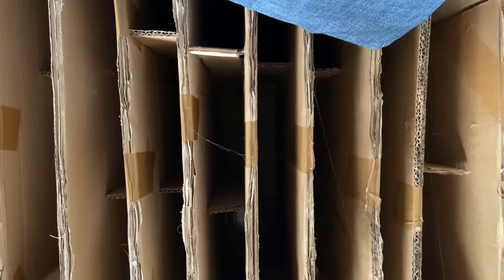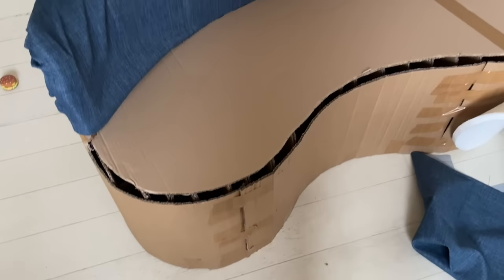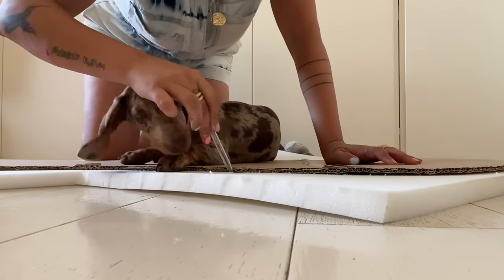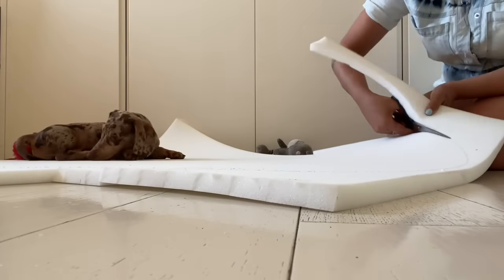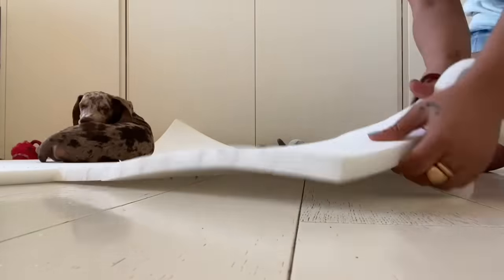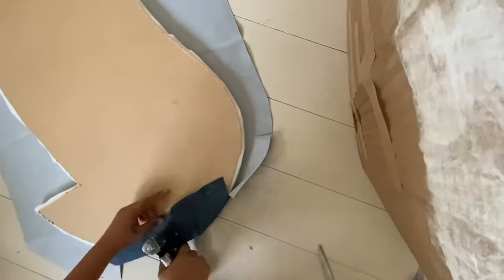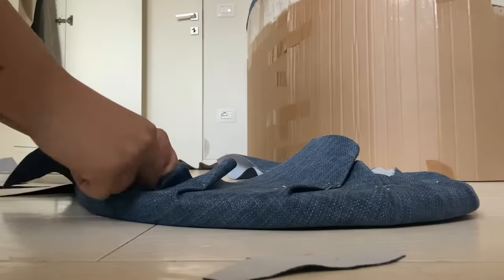Now you can finally staple your fabric around the cardboard. For the front I first needed to place a straight sheet to cover the holes so the stability carries to the front and you wouldn't feel it on your butt when sitting. We're adding foam also on the bottom, following exactly the same shape - I placed the couch on the floor, traced the line on the foam, drew it and cut it out, then glued foam pieces together. For the fabric I cut it a bit wider - about five to six centimeters extra - so I can staple it inside. Because it's a rounded shape, you'll need to make lots of little cuts to wrap it around easily.